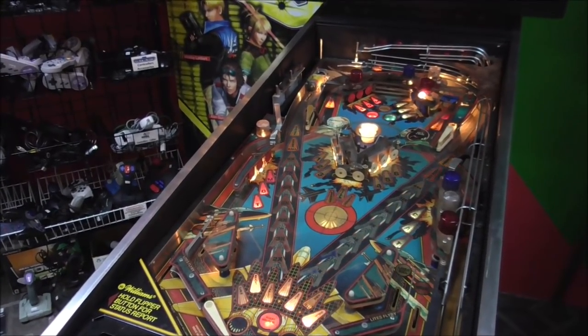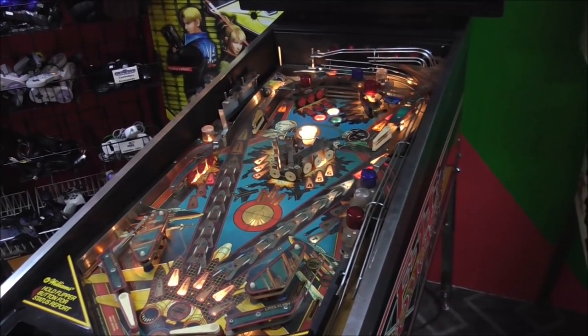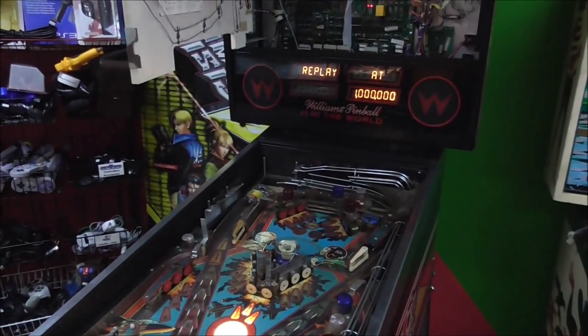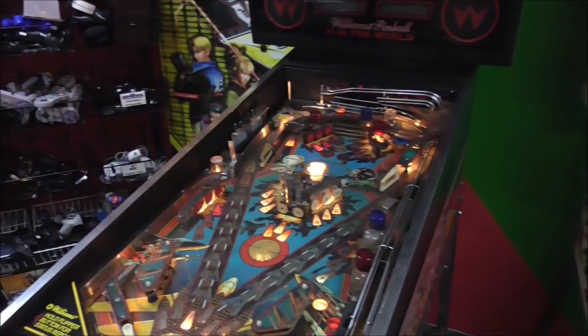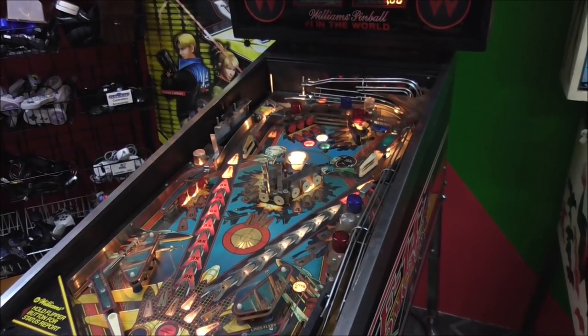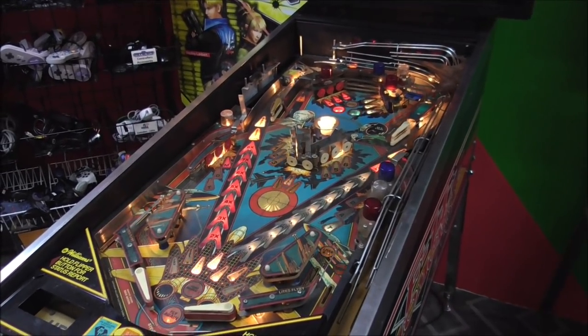So if you got it louder than that, you still got some kind of ground problem somewhere. Sometimes it's the caps and stuff, but 95% of the time you got a bunch of screws missing. So check that out if you've got that problem. All right, folks. I think that's it for today.